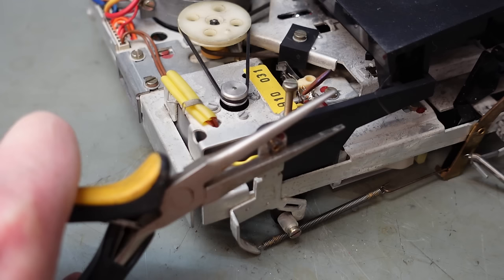About 1 RPM. That blooming racket. Then we adjust 6R8 again. So we get the right waveform. Not the most stable thing. We're looking for a straight line. That's what's important. Now adjust 6R13 for a quick running motor.